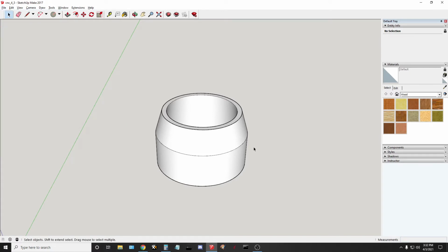I'm pretty sure. So sometimes on 3D printers, when you go to print, some printers might not be calibrated perfectly, which, you know, some people are wanting really tight, but if you find that a part isn't quite where you need to be, especially radiuses, you can go into the slicer program and give it a percentage like 0.40% or 0.4% plus or minus, where it might increase or decrease the size a little bit. Then you'll get closer. It's just a fudge thing in the slicer.